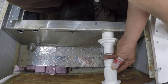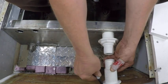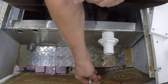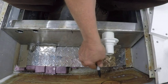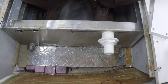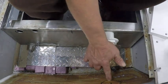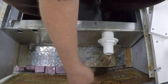We'll go ahead and mark this thing on the side of the boat. This is the outside of the flange on the outside. I tried to find an area that's nice and smooth with no big bends in it so that everything would lay nice and flat, and that worked out perfect. So I marked the outside of the flange. Now all I'm going to do is mark dead center of this — eyeballing it, that's pretty close. We'll go ahead and drill a 3/16 hole right through there as the pilot hole, and then we'll drill it from the outside back toward this.